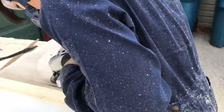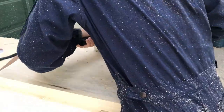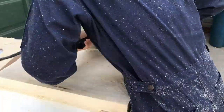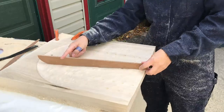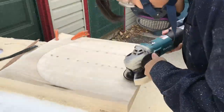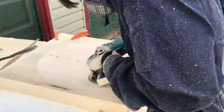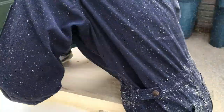Second, burr carving discs often become coated with a buildup of resin that's difficult to clean off. This in turn heats up the burr disc and dulls it faster. The Arbortech has wide gullets that quickly evacuate wood chips from the cutting surface, so it never really accumulates resin. Keeping the blades clear from the chips also keeps them cool, so they stay sharper longer.